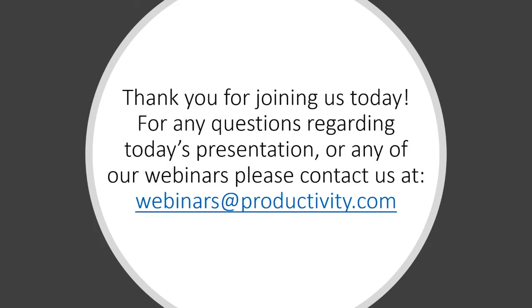Because I need to know the incremental value of where I am when I start my probing cycle and how far down it's going to go. It's that incremental distance, not from a zero point. The control doesn't know what that is necessarily, so I just find out what that is through zeroing out the display so I can get that value. I know that's a little hard to follow maybe. So if that continues to be an issue, or if you're a little confused by that, maybe get a hold of us and let us know that you need some additional help.